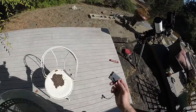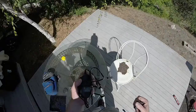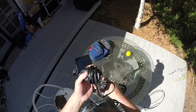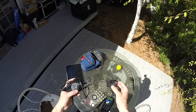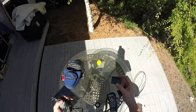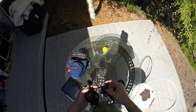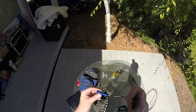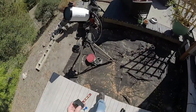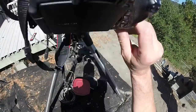What I've done with my AC power or DC power for the cameras is this is an inexpensive — I think they're like $13 on Amazon — AC adapter for Canon. What I've done is just sacrificed one of these by cutting it and putting DC connectors in the wire. And that way I can connect it to my wiring harness here.